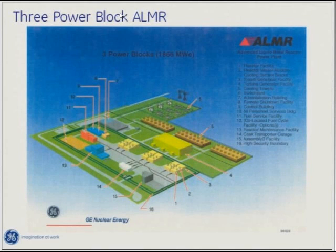This particular plant has a fuel fabrication center that takes spent nuclear fuel and divides it up using electro or pyro processing — electrochemistry similar to what's done at an aluminum smelter like Alcoa, where you put electricity into a salt with alumina and get aluminum. Once at steady state, this facility needs about 50 tons per year of spent nuclear fuel to keep it running and make electricity.